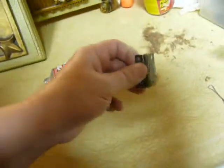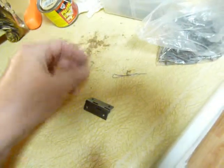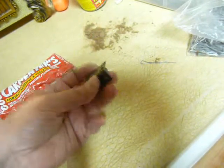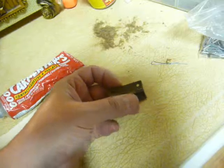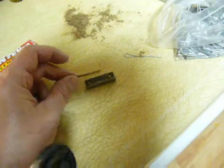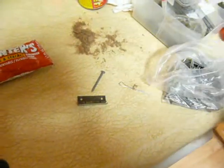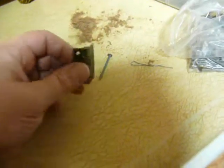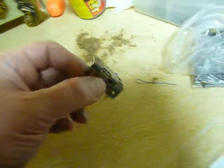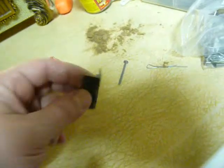The other thing I wanted to show you is how to fix the hinge. This hinge had a paper clip through it, and I think that's why it broke — the hinge pin came out. The way to fix it is to go through your nails, find one that's the right dimension, ideally a little snug. Use pin nips to cut the head off or trim it to the length you need, then pound it in. If it's a little loose — this one was a little loose — I just used carpenter's glue to cap it so it wouldn't fall out. That's how you can fix a hinge pin rather than buying new hinges.